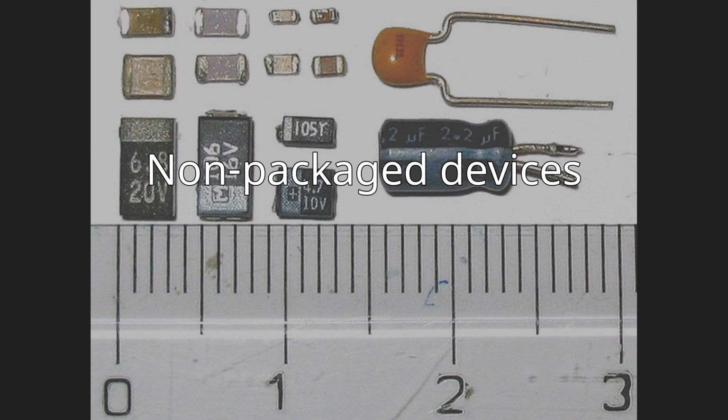Chip-on-glass, COG, a variation of COB where a chip, typically a liquid crystal display, LCD, controller, is mounted directly on glass. Chip-on-wire, COW, a variation of COB where a chip, typically an LED or RFID chip, is mounted directly on wire, thus making it a very thin and flexible wire. Such wire may then be covered with cotton, glass, or other materials to make smart textiles or electronic textiles. There are often subtle variations in package details from manufacturer to manufacturer, and even though standard designations are used, designers need to confirm dimensions when laying out printed circuit boards.